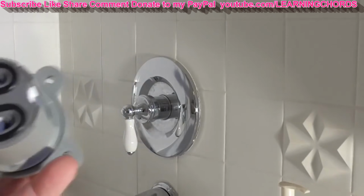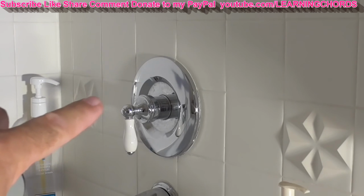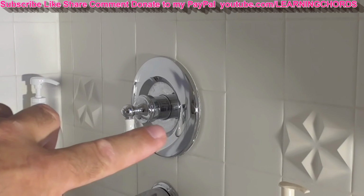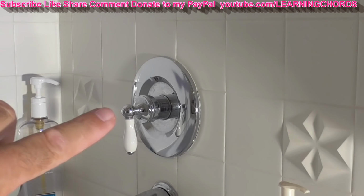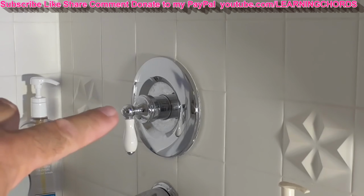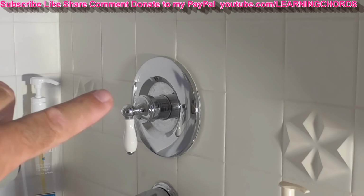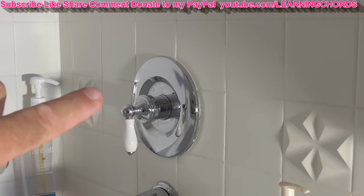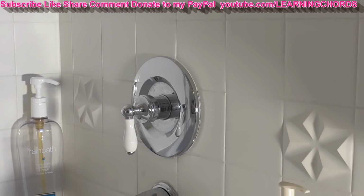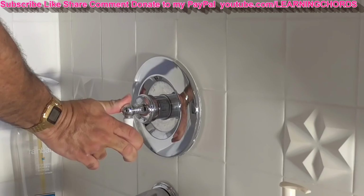What you need to do on a lot of these faucets, some of the faucets have a shutoff right behind that escutcheon plate over here. You're better off shutting the water off to the place. If it's an apartment or a house, whatever, you're better off shutting off the water, because if you try to turn off the water with that little screw valve behind and it starts leaking or you break it, then you really are going to have a big problem. So turn off the water and let me show you what the problem is now. The problem is, you can see the amount of pressure.